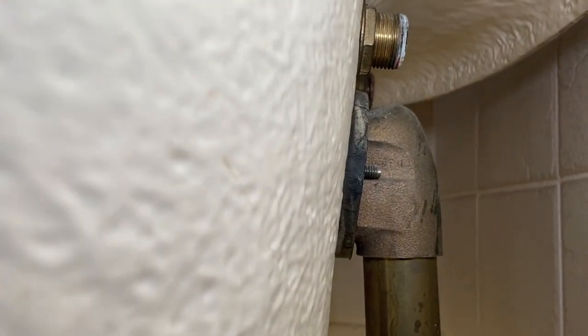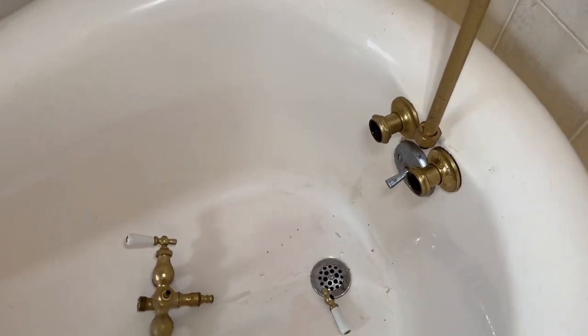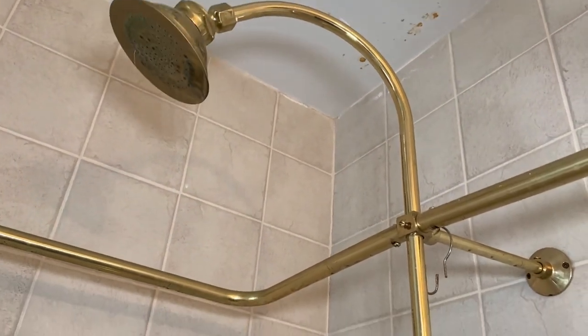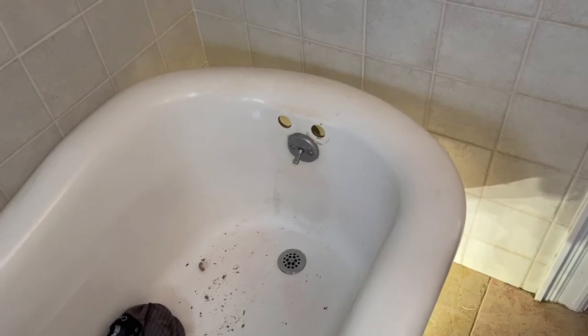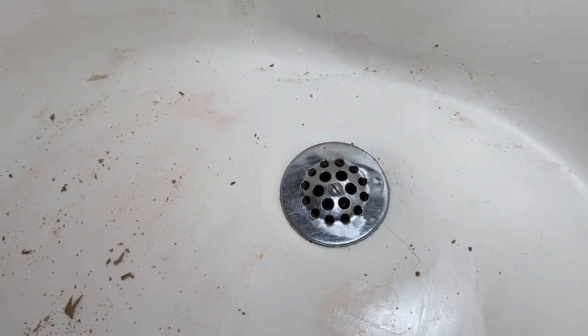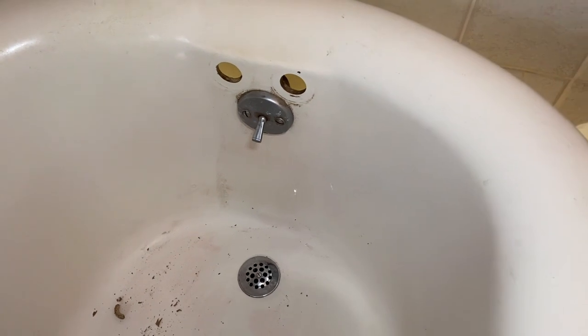Now with the water back on, it was time to remove the old unit from the tub — which was a pain in the neck because I had to use a little six-inch wrench to try to get those lock nuts off. I had no access from the front like I did with the new fitting. Here I am loosening up the shower riser, then it was a process of taking down the shower rod and backing everything off. I ended up with a bare footprint. Before installing the new faucet, I wanted to deal with the strainer — if it moved, I'd address the leak; if not, I'd come back another day.